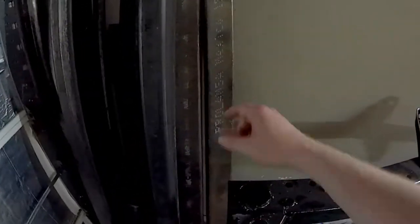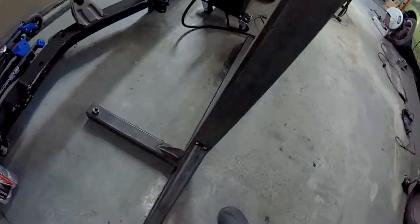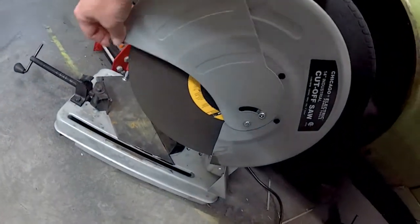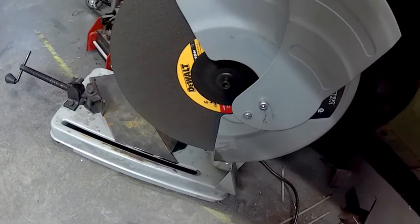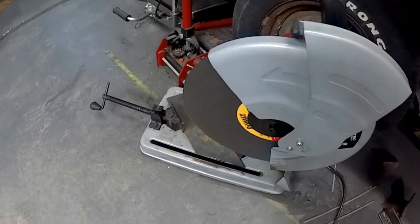I've got that Cormark Metals there — they had all the black pipe and the 2-inch that I needed. I could not find any scrap metal in 2-inch; I found some scrap metal in 3-inch and 2½-inch with 3/16 sidewalls. And then these gussets are all quarter-inch, 4-inch flat plate steel that is quarter-inch thick. I'm also trying out the Harbor Freight chop saw here with a new DeWalt blade, which is hopefully supposed to go better. The previous blade was not great for the thicker metals, and the Harbor Freight disc that came with it wouldn't cut through at all.